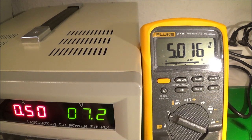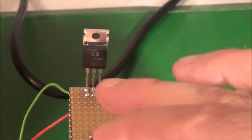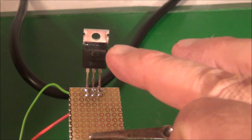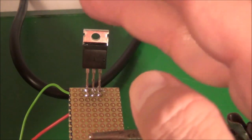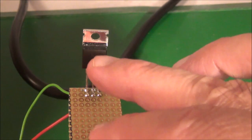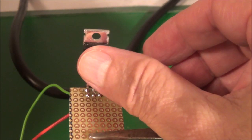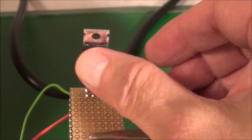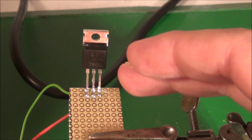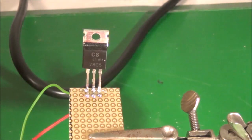This is just a bare-bones circuit to show basic troubleshooting. Normally this would be mounted on a heat sink, because these things get really hot. Once they reach a certain temperature or get a short circuit, these voltage regulators will basically shut themselves off until the short or high temperature is removed, and then they should work again as normal. I'm going to go ahead and try that next.